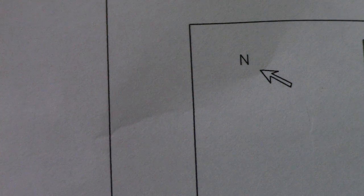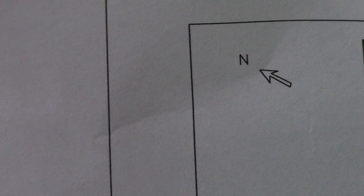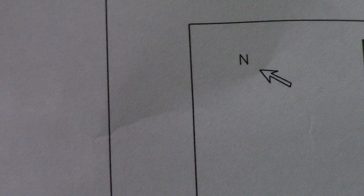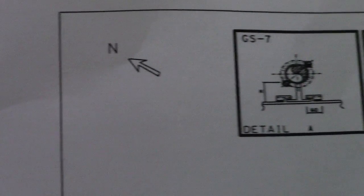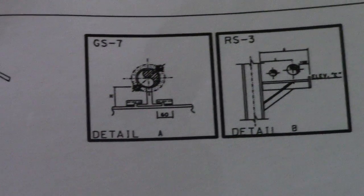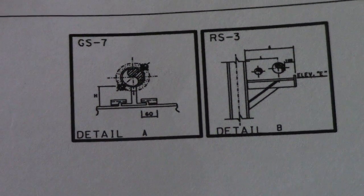This is the orientation of Northing in isometric drawing, and it is a very important reference for piping. If you are going to fabricate and install the pipe from the field side, the first thing to check is the orientation of Northing. Also from the isometric drawing, here is the support details section.